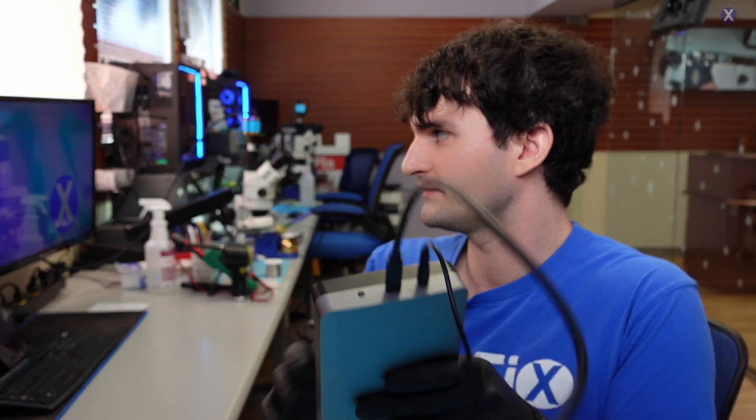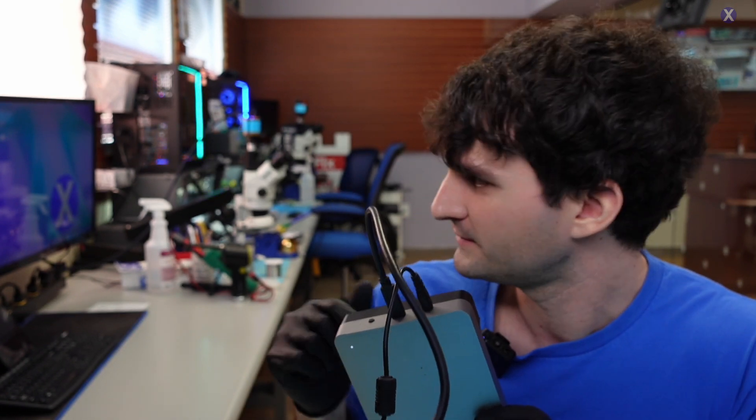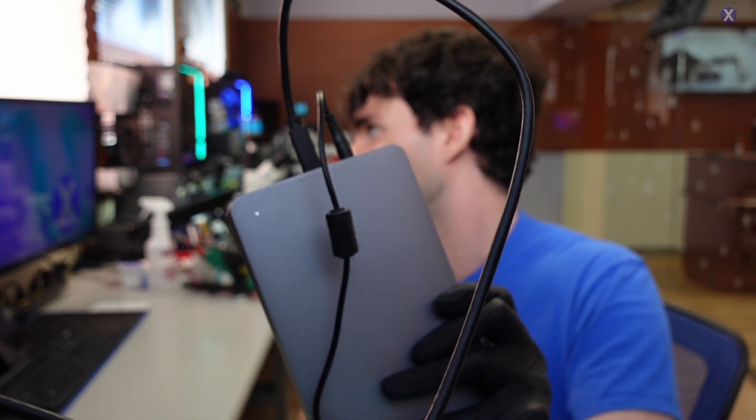Let's go ahead and see what it's doing right now. I'll connect the cables — I have the other one plugged in. I've got a USB-C one, though I'm not very fond of USB-C outside of phone connections. So we plug it in and I heard things spin up, or at least try to spin up. We're looking at this light — for power — and if it blinks that usually means it's communicating with the drive. But the light went off, so it looks like there's probably a communication issue with the drive itself.